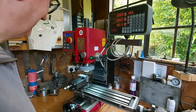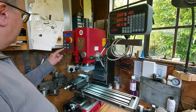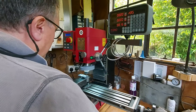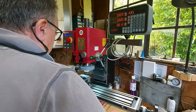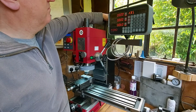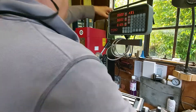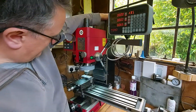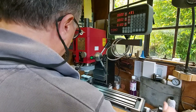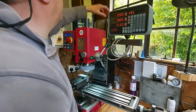I've got the Z-axis working — that's really good — and I'm just going to machine this bracket. This is the aluminium bracket that's going to go on the back for the Z-axis. I'm going to go from here and take a massive cut and do it. I'm going to wind this down to one millimetre. I've slightly tightened up the travel so that I've got a bit of control. If I put my hand on this I can probably move it down — not much. That's alright.